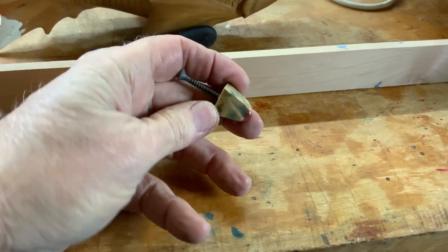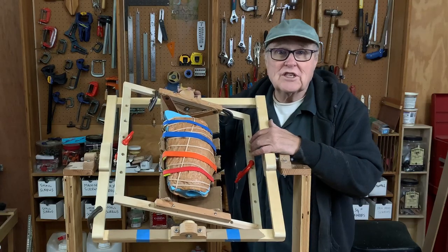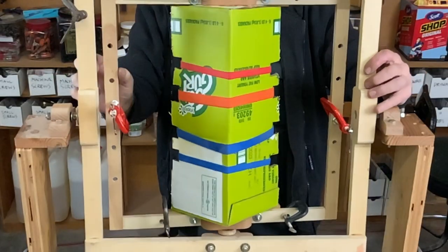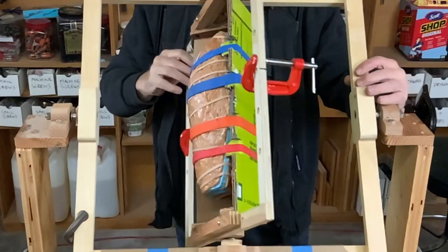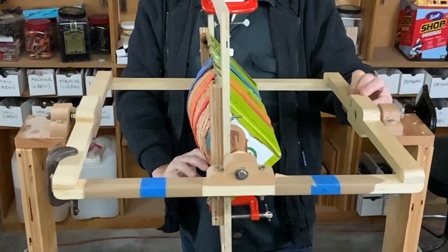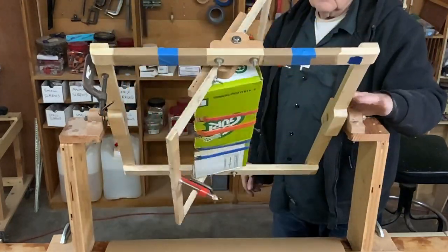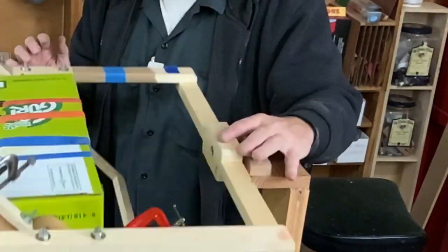This was the funnel that created the pour spout — now I'm going to use it as a plug to keep the resin in the mold during rotation. I've got the cradle and the mold all mounted up into the machine and it's pretty well balanced in this direction. I use C-clamps positioned all around the machine and that balances the whole thing out, because you want the machine to be basically in balance. If it was balanced in this direction it would stay upright, but it's heavy on the bottom. You can actually use that out-of-balance to your advantage because once you set the mold to spinning, you can keep it spinning at the lightest touch with hardly any effort at all.